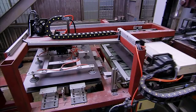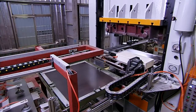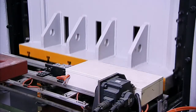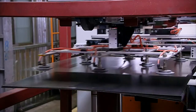If you're looking to fully automate the process, Wittori offers the integration of robotic loading and unloading units, movable bolster and automatic die clamping and changing. These additional components offer significant safety benefits, along with lights-out operation capabilities.